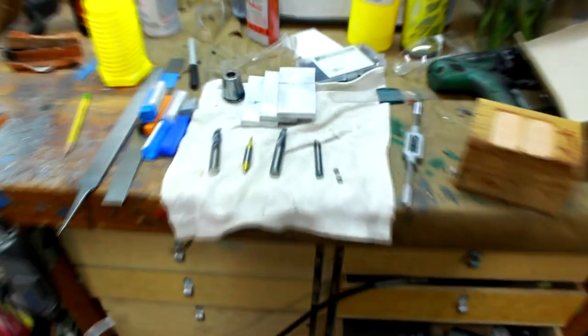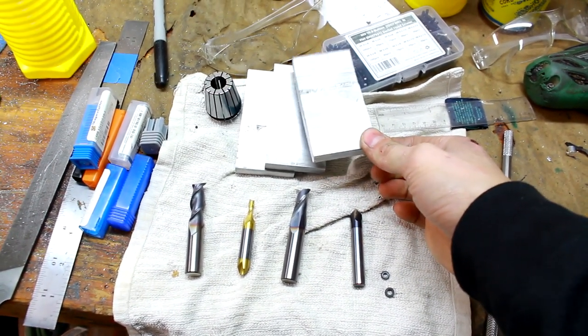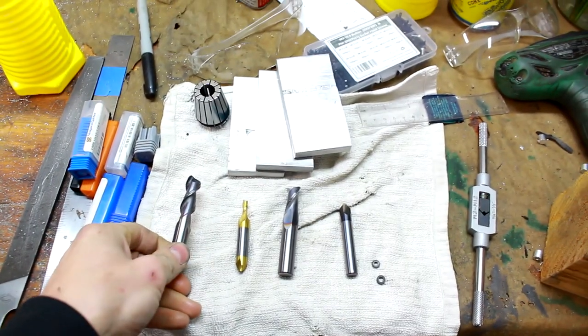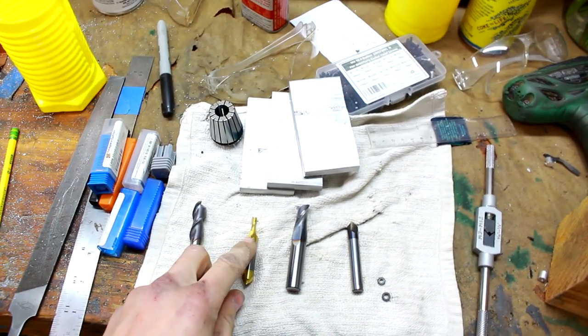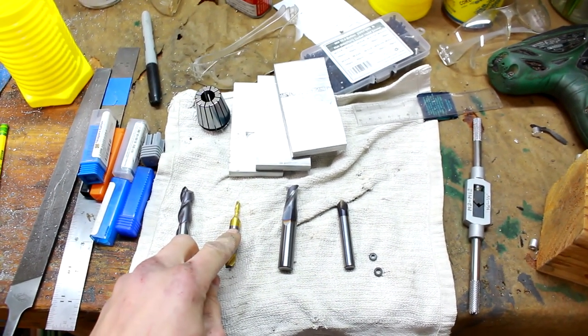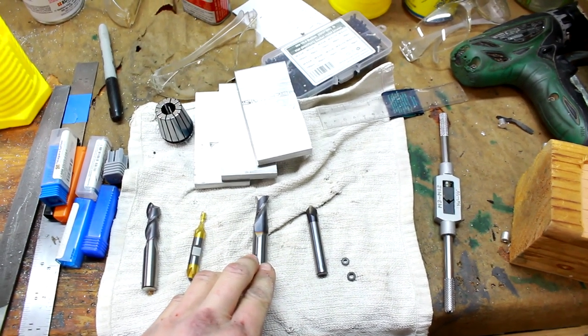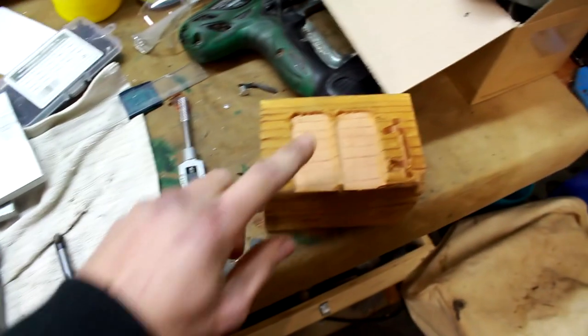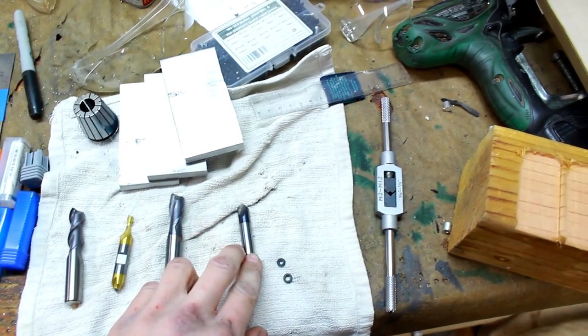I've got three stock blanks cut out roughly oversized so I can bring them right down to dimension — hopefully only need one, but I'm probably going to need at least one of the others. I've got a half inch carbide end mill for roughing since the corners are a little chipped. A three-sixteenths end mill for the link slots — small with a nice thick shank, real short and rigid. A half inch end mill with a 30 thousandths corner radius for the main areas. And my chamfer bit for the chamfers. I'm going to time-lapse getting the stock roughed in because it's kind of a boring, laborious task.